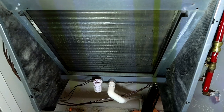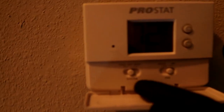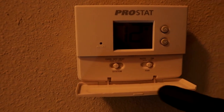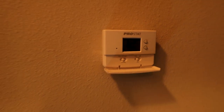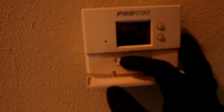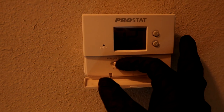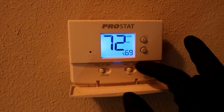It's nice and thawed out. When I'm on call, like this week, if they call and say 'hey my AC's not working,' I'll say 'do me a favor - turn your thermostat off and turn your fan on.' So by the time I'm on my way to the property, it'll be thawed out when I get there and I don't have to wait. Sometimes it's completely thawed. Some of the bad ones there's really a block of ice - it doesn't thaw all the way, but most of the way.